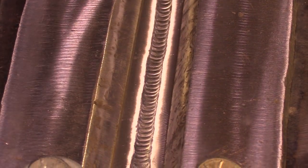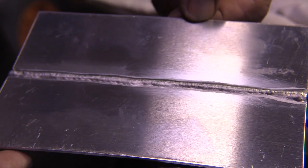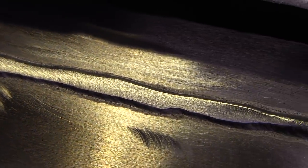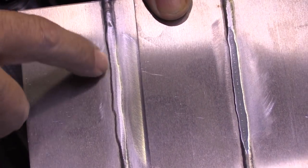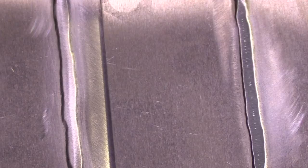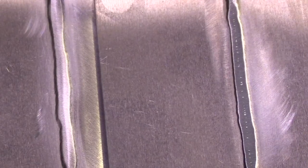No argon purging on the backside, just air. So let's take it out of the fixture now and look at the backside and see what we got. Okay, punch through — it doesn't look as good as it would with argon or with even a better chill fixture. But now I'm going to do the same thing — I'm going to buff this down with Scotch-Brite pads, both brown and burgundy, to get it shiny enough to reveal any pores if there are any, and you don't really see any. I think there might have been a tiny little pore or two, but what a difference. The only thing really different that I did is I cleaned one and I didn't clean the other. The main thing, after doing a bunch of these, I know the main thing was cleaning that sheared edge. Of course, it doesn't hurt to clean everything with acetone and a wire brush. When you see porosity in a straight line — linear porosity — you would tend to believe there's some kind of contaminant in a straight line, and that would be the sheared edge. I know this because I've dealt with a lot of these joints, and that tended to be the culprit in most cases.